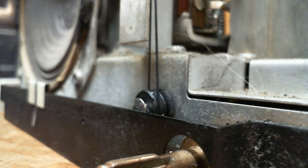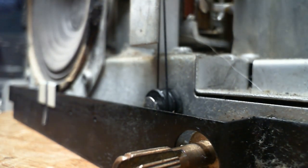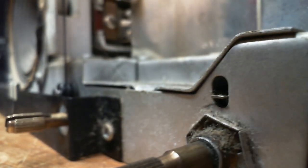Okay, so what are we going to do then with the whole string situation sitting there? We kind of need to resolve it, because without resolving it we cannot really align this radio, because the pointer position on the string is critical to the whole alignment process. While we've got that camera going, let's take a closer look underneath.